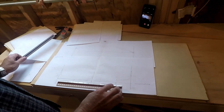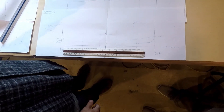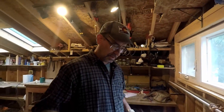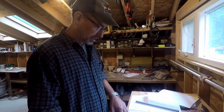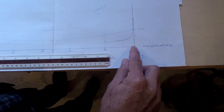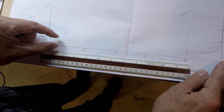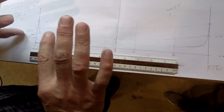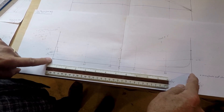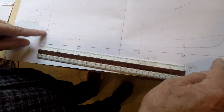Laying out this drawing, we've got the reference mark — it's 14 feet long. I chose 14 feet because it's a manageable garage-size boat that won't get too heavy, but it's big enough to put four or five people in to row around, motor around, or sail. We've also got a reference line we'll use to actually position the ribs on the strongback. The boat will ultimately be built upside down, and that line will be represented by a chalk line — a string tightened across. These measurements can be directly referenced down from that reference point and translated into the actual ribs.